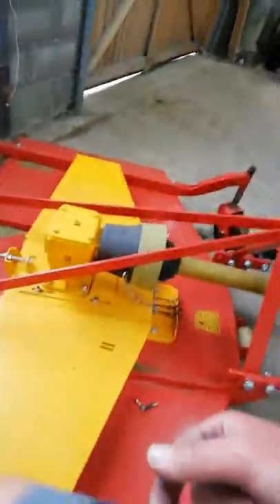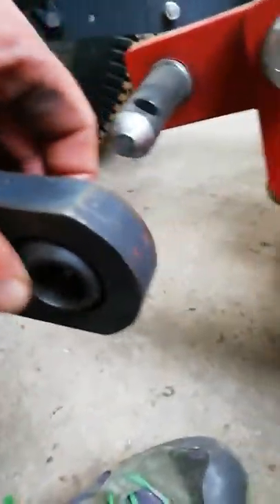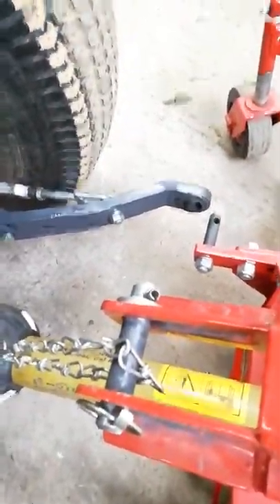At this point onwards, the best thing to do is turn the tractor off — you don't need the power for anything anymore. First thing we're going to do is link up the two bottom arms to the three-point linkage. There are little bits in here — difficult one-handed, but we'll give it a go. Slide it in all the way, locking pin in, and then we'll do the same on the other side as well.